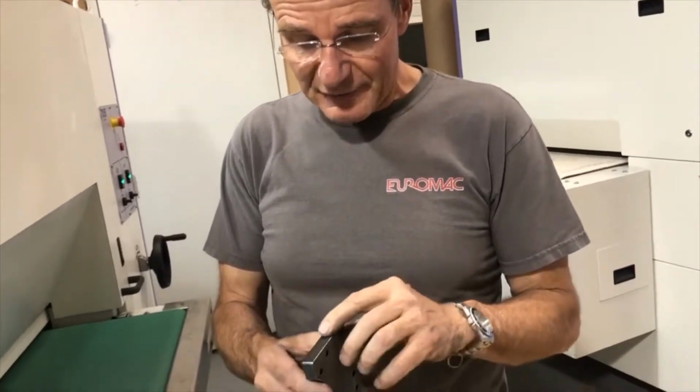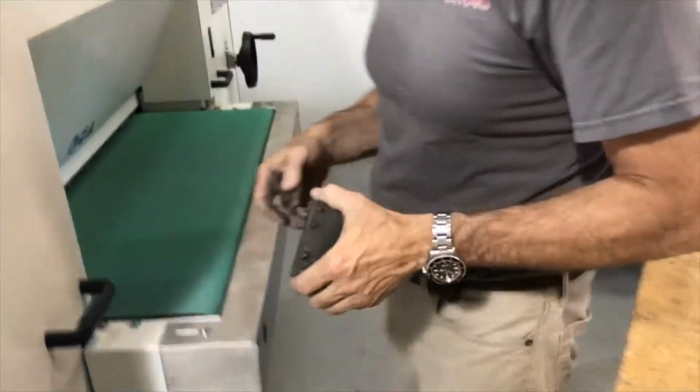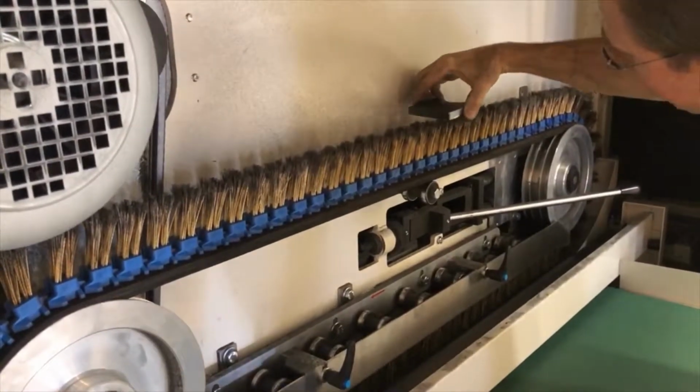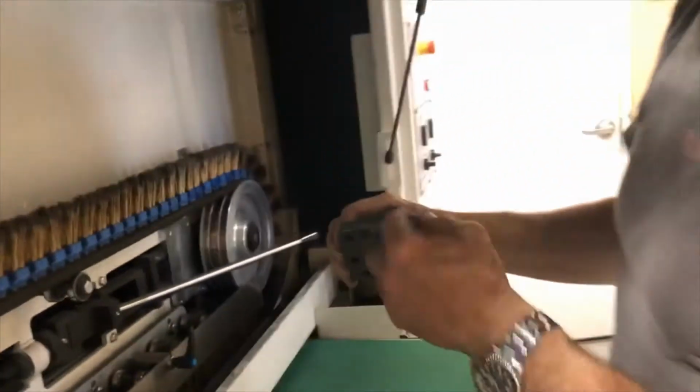So now on these parts, you wanted to have the laser oxide removed. On thick parts like this, cut with a high power laser, that can be very difficult. We put in these wire brushes. As they hit the part, they hit the side and then they brush by pushing down.